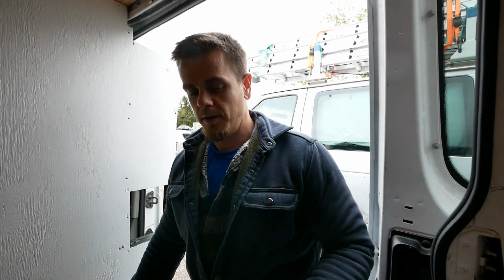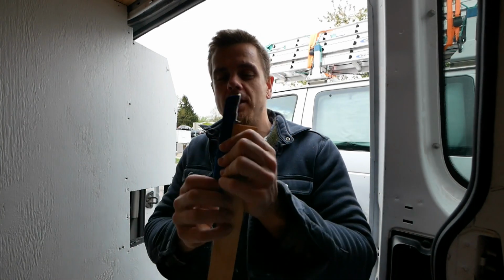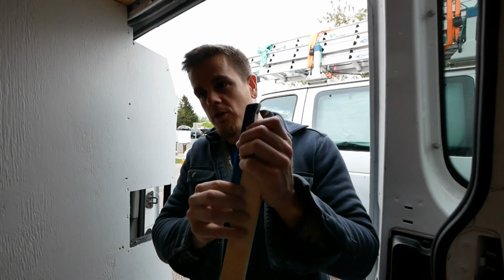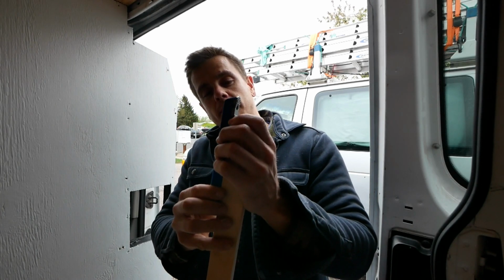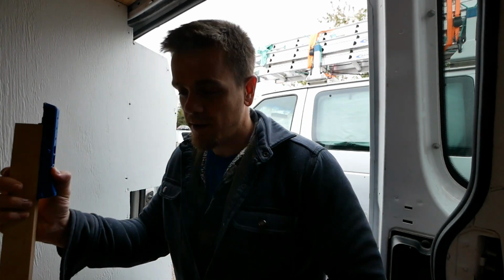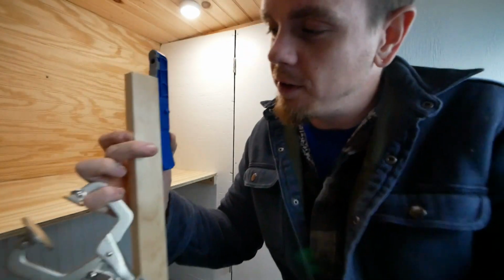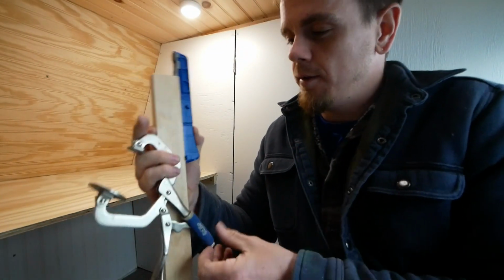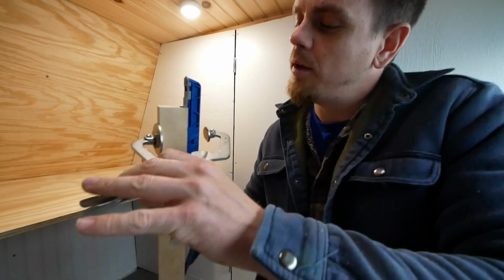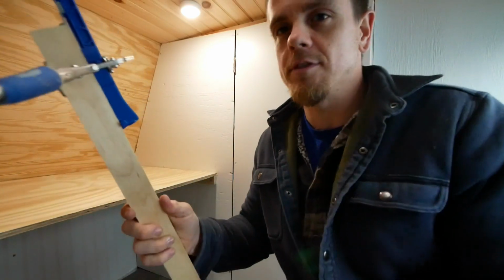Alrighty. So you can actually adjust at what point it goes into the wood. Thinking 1½ inches is good, so I can use a longer screw. All right, let's do the one side and then we can always flip it around to the other side. Anyway, here it is, and you clamp it on here. This is a Kreg jig, got it at Lowe's. I think it was like $40, but it's a lifesaver. All right, you clamp it on there so it doesn't slide off.